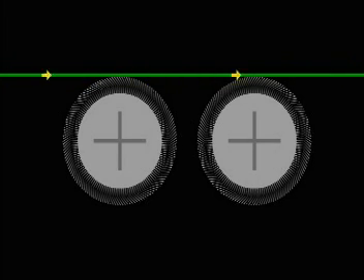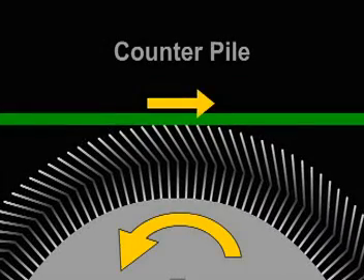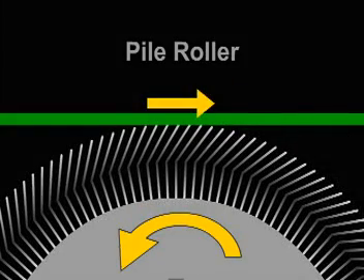Wires are bent and arranged so that points strike the surface of the fabric in one of two ways. One roll contains wires with points that directly strike the surface of the yarns in the fabric in a piercing way. This roll, referred to as the counter-pile roll, pulls fibers from the surface in an unorganized manner. A second roll uses the backs of the bent wire points to strike the fabric in a more combing manner. This roll, referred to as the pile roller, organizes the fibers that have already lifted from the fabric and makes them parallel.